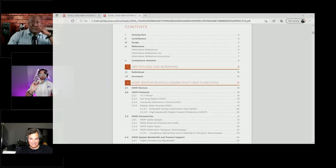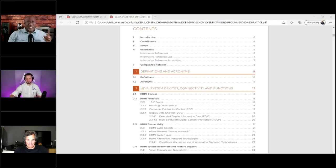Okay, so 2 meter tip number one. Not too many cables, especially when you're getting into HDMI 2.1 48 gig stuff, would probably give you the best performance. The minimum length ensures performance. Of course, as you increase length, it eventually gets more and more challenging. We have to go from passive copper solutions into things such as optical and active and things like that. And Jason actually has a piece of that, which we'll talk about.